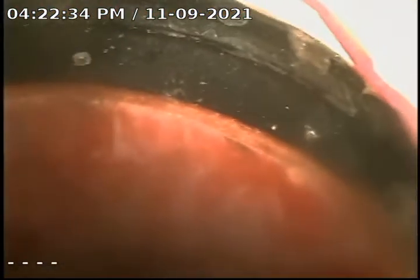Here you can see this is the other shift that was in the clay, and at this joint is where it changes to the PVC. You'll see our liner ends in the PVC here, just before the drop down into the city main. Here you can see this is the city main. We will go ahead and continue our recording as we pull back.